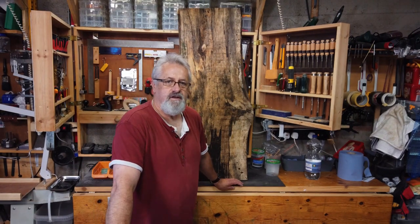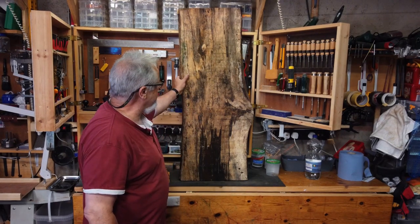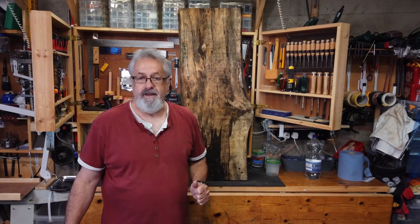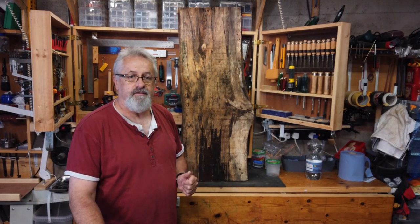The first thing to do is prepare a cutting list. And then I'm going to start off with ripping this piece of wood to the different thicknesses, then put it on the planer, do the thicknessing, and then back on the saw, cut them all to length. I'm going to fast forward through most of these steps. And this is at least a 2-day project, so after each phase I'll do a bit of an update. And then hopefully we'll have good results. And see you in the next update.